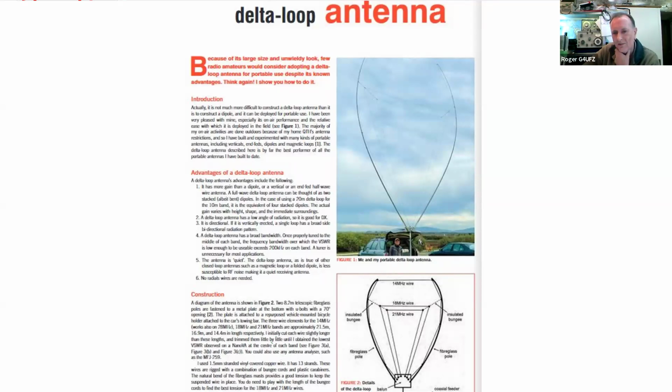I wonder, when you're tuning the multi-element, the fact that you've got multi-bands there, do you get interaction when you're tuning one and shortening one, lengthening one, whatever? Do you get interaction with the other bands much on that antenna? Yes, you do. However, the interaction is very minimal. I did make the adjustment little bit by little bit, but to my surprise, I expected quite a bit of interaction, but the interaction was not a major issue.